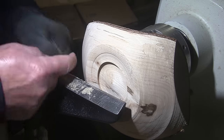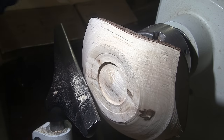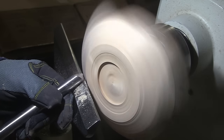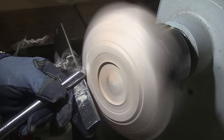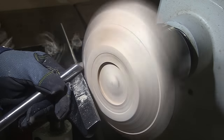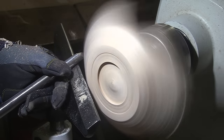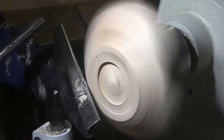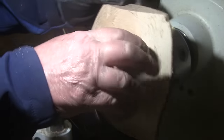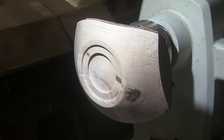That probably looks better. Now I can come back over here to the side and finalize the shape. We're just about there really. I'm gonna go sharpen up — this wood is pretty dang hard. I think that's good. Time for sanding. I'm gonna be starting the sanding at 120 grit and work up through 400. I have the lathe spinning in reverse at 400 RPM. I'll show you what that looks like as soon as I get my mask on.